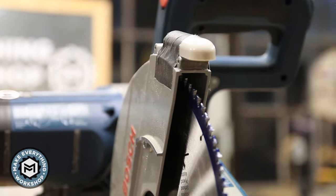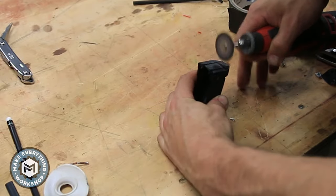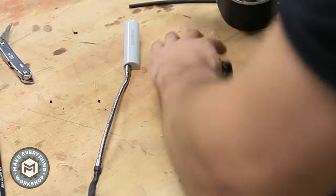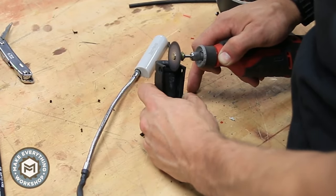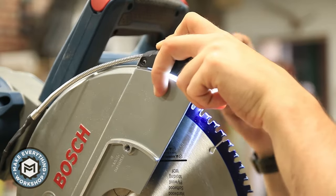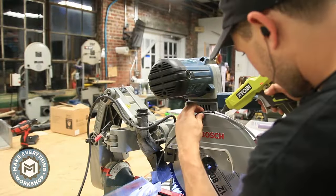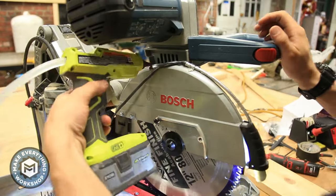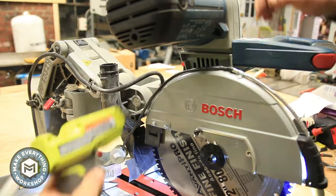On this particular saw I can modify that little black plastic piece and put it back on the saw with the new LED light so it looks more finished. I'm using a plastic cutoff wheel on the Dremel to cut out the shape that will hold the LED light housing — taking little bits of material off to get it tight. The Dremel is great for this because it just eats away at the plastic. I'll put two screws in the back to hold it firmly, then attach the wire with hot glue so it looks clean and is replaceable — if it pops off on a job I can just add another dab, which is better than tape that fills up with sawdust.